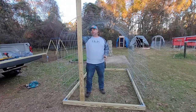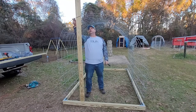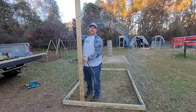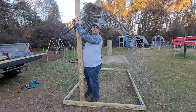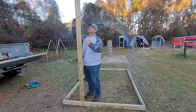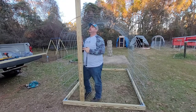Basically you want to get a level, put your level on the side of the board, make sure the board itself is level, and that's going to tell you where you need to cut. You could just cut it straight and have it stick up — that's perfectly fine. Then we use the metal plumber's pipe hanger tape to affix these, and it'll hold them in place. The ones on the bottom can be a little loose just to hold it, but these need to be quite tight because the board has a tendency to move if it's not really tight.